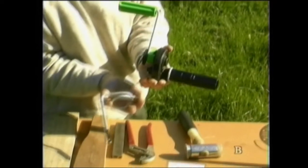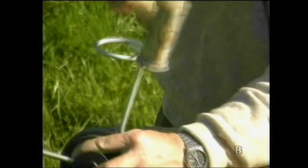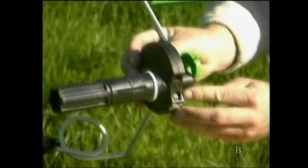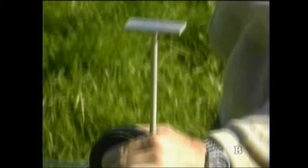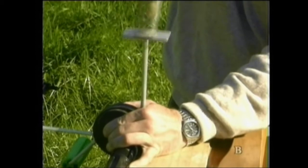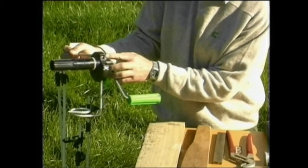There's a white cross marked on the bottom on the end of the guide, which aligns with the white cross on the gearbox. Place it in, rest the scalloped edge of the gearbox on the wooden buffer, and tap the guide home. If the guide comes to the end of the docking box, it's in far enough. Finally, we need to drive the chassis into this other docking box, and in this case we really can't go wrong. Once again, resting the scalloped edge on our wooden buffer and driving the chassis firmly into position. Again, we're looking for the end of the chassis to be at the end of the docking box.